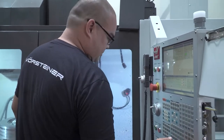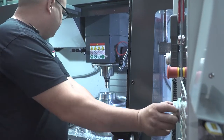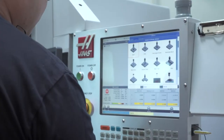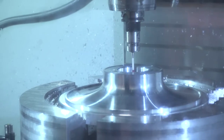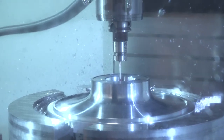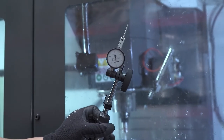What we're going to do right here is center the machine. We don't dial in wheels the old school way — we have a laser probe, so it's exact every time. We're going to set the offset, then dial in the bore, hit start, and just like that it's probing and centering the part. The probe takes four coordinates: Y positive, Y negative, X positive, X negative. Once it's dialed in, the tolerance is way tighter than using something ancient like this. That's old school — the laser probe is the new school.